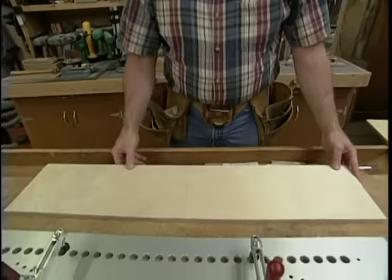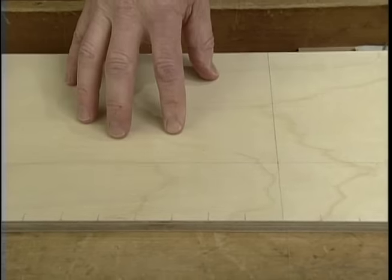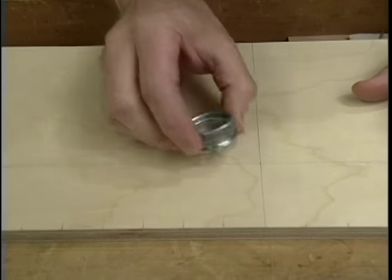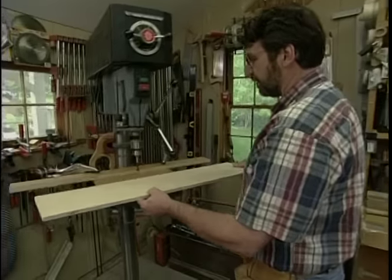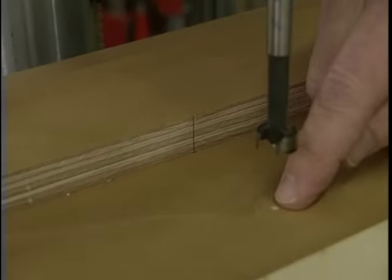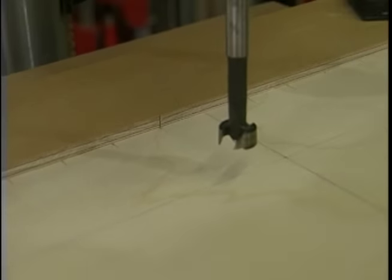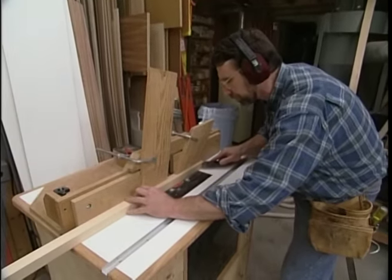For our new jig I'm starting with a piece of half-inch cabinet grade plywood, 8 inches wide and 36 inches long. I've laid out a center line, which will be used when we actually use the jig but it's also the layout for everything else. The first step is to drill some holes for this collar which goes in the router — there'll be one inch on center all the way down this line. To make those holes I've set up my drill press with a 5/8-inch Forstner bit, a piece of plywood on the base so the bit won't hit the metal, and a fence set up square, with an index line. But before we use any power tools — be sure to read, understand, and follow all the safety rules that come with your power tools. Knowing how to use your power tools properly will greatly reduce the risk of personal injury, and there is no more important safety rule than to wear these safety glasses.